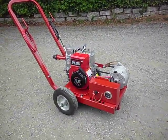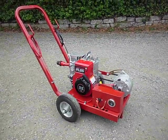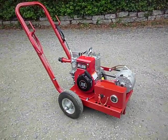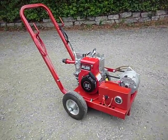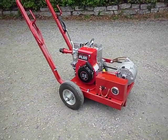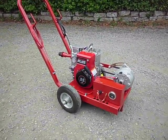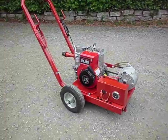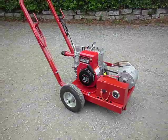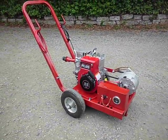I saved a lot of time on this build because I happened to find it at a local salvage yard, scrap yard. This cart used to be a pressure washer cart or something like that — it had a handle, a base, and little stub axles. It didn't have any wheels or tires, but I had some sitting in my garage. The stub axles were a different size, so I just cut those off and welded on my own stub axles. About 90% of the fabrication on the cart was already done for me, which made life really nice.